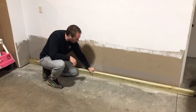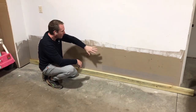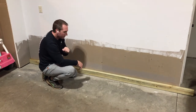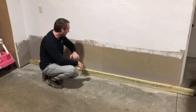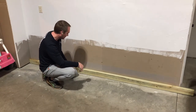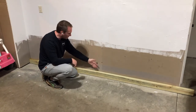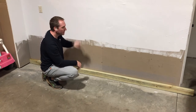Next step is I'm going to do some wainscoting up to about here to protect the lower wall. I've wanted to do this in the garage for quite a while. This drywall is very susceptible to bikes, golf balls, things like that coming in at a high rate of speed and destroying it. So I want to add protection up about three feet. I'm going to start with a treated 2x4 at the bottom, go up with some corrugated steel, then cap it off with another 2x4 — kind of a chair rail deal at the top.